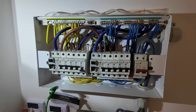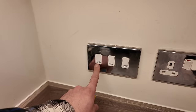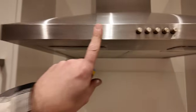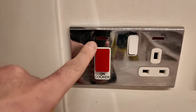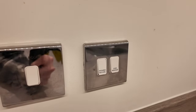The other thing we want to do is remove any sensitive loads. Let's go around the kitchen. Some of these built-in appliances will have to be turned off because they'll drag down our readings — we'd be zapping the appliance itself. The cooker hood, for example, has lights and a motor that will drag the reading down. Same with anything with a neon — if we leave that on it will start lighting up when we're testing.